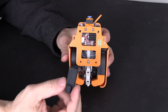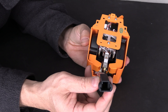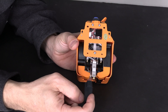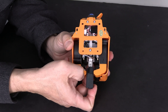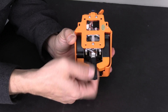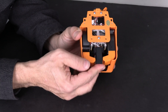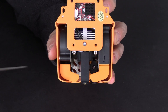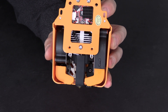With this done, place the silicone boot back on the hotend. Looking at the back of the boot, the elevated portion will face up and the screw holes will face down. To reattach it, rotate the boot so that the two lumps can clear the shroud. Slide it upwards, straighten it back out, and press it firmly up into place. You should see that these two lumps are covering the two screws we just tightened.